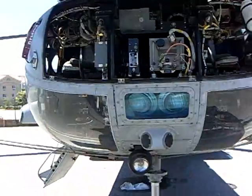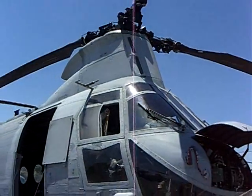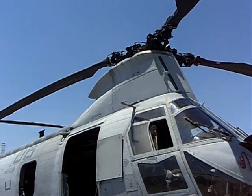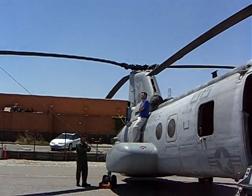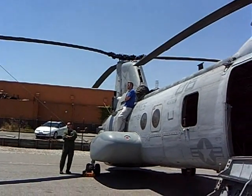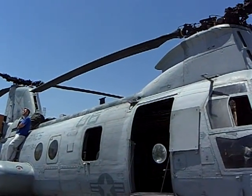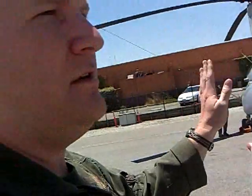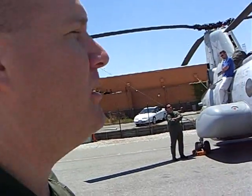Taking a look from the front, as you can see we've got a forward and aft head with three rotor blades on each, and those are synchronized so that they'll always be locked out at that position while in flight. The heads program forward and aft based on your airspeed to take the stress off the rotors, so as we increase in airspeed the forward and aft head will actually move forward and back to get the best clearance on the rotors as they're coming around.